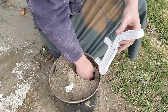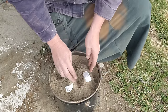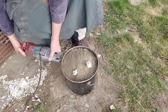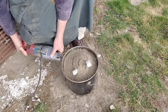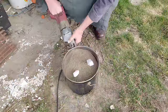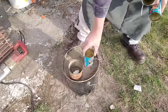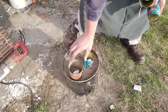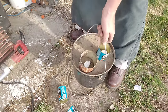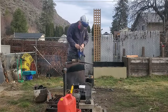If you have bigger parts, that's where we could run into trouble — we can actually distort our parts a little bit by packing the sand down. I'm going to grab the recip saw and just vibrate the sand down. As we vibrate the sand, it's actually a form of packing everything down. Now these two soup tins that you see me put here — this is going to be the reservoir for the molten aluminum. This is super important because it's going to give us some head pressure when we pour the molten aluminum in there and it's actually keeping the walls of the sand back.